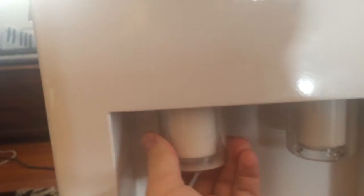These are replaced simply by — they're on a pivot here, which makes it a little easier to grab when you want to remove the filter. This is what they look like. You stick it up in this slot here. It should stay on its own, and then you put the housing around like that. There will sometimes be a little bit of crystal in the bottom of the canister — a little bit is okay. You can pour it out when you see it in there. It doesn't make a big difference. If a lot of it accumulates in there, it may mean that the seal between the filter and the place that it lodges into up here is loose.